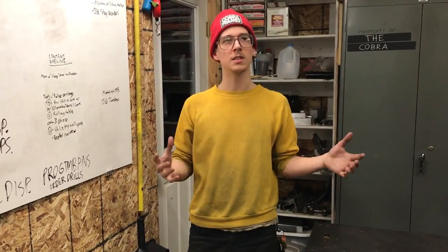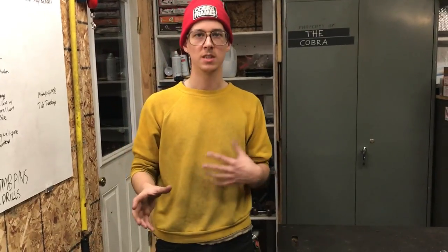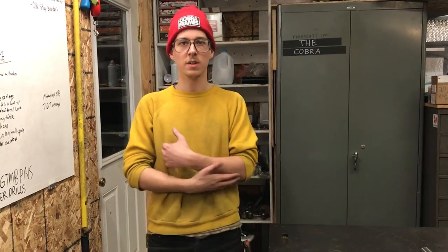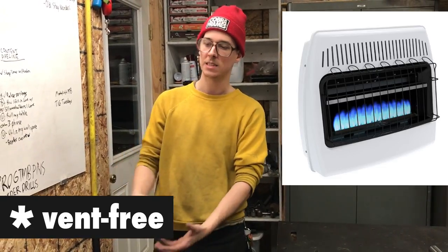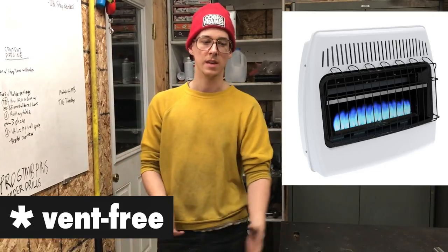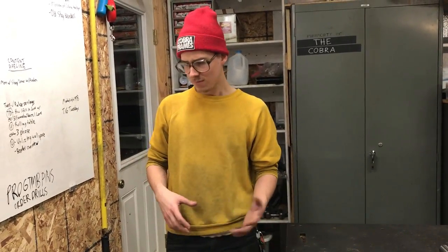This is almost like my home, so I need the air to be safe and breathable. I have expensive machines and bike tubing that's steel — I don't want that to rust. I want it to be temperature stable and I don't want combustion gases and carbon monoxide filling the space. With a non-direct-vent heater, it burns the air within your space mixed with propane or natural gas, and you get all that combustion gas and condensation building up over time. You'll get rust issues and it's just not ideal. The direct vent approach is much more civilized and livable.